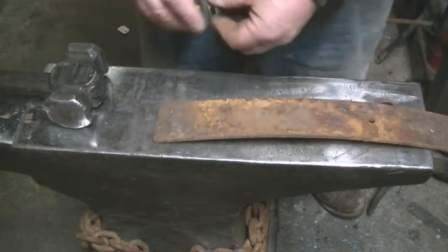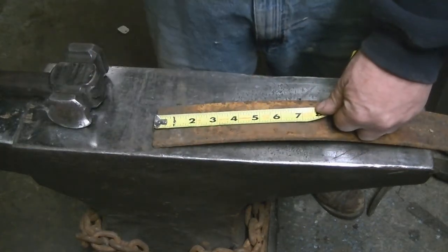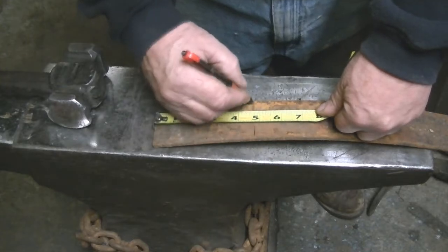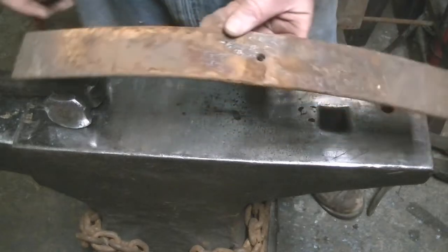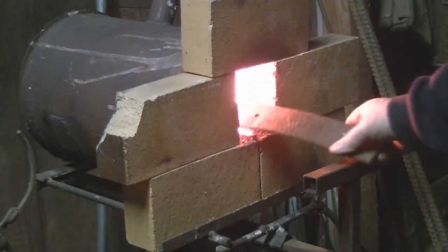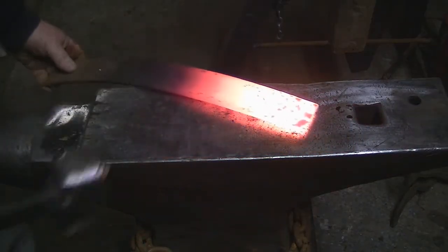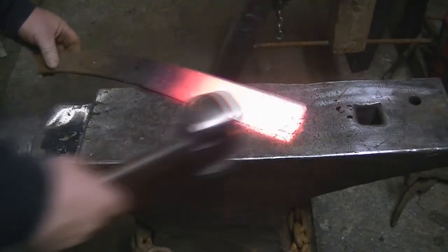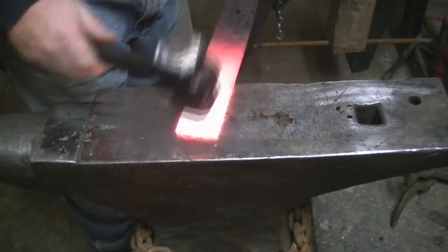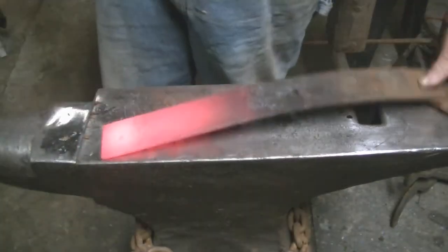What we got here is a piece of leaf spring from a 1931 Ford Model A one-and-a-half ton truck — it's an overload spring. We're going to cut it off at five inches. I marked it at four and three-quarter but moved that to five later on. The hammer is slightly smaller than the anvil portion of the railroad track on the power hammer, so I need to increase the face on the hammer to match the anvil. We'll give this thing a good flatten, anneal it a little bit, and wire brush it up real good to get as much scale off as we can — this thing's rusted up pretty good.